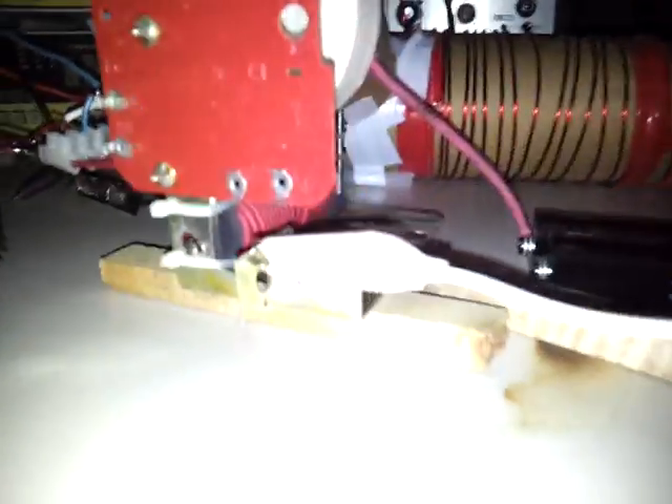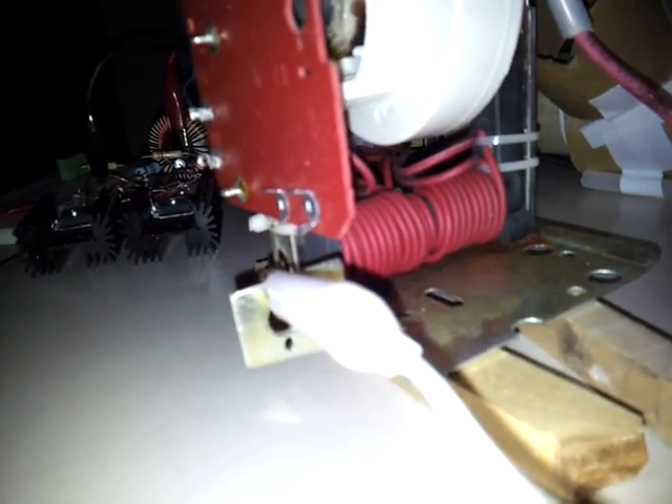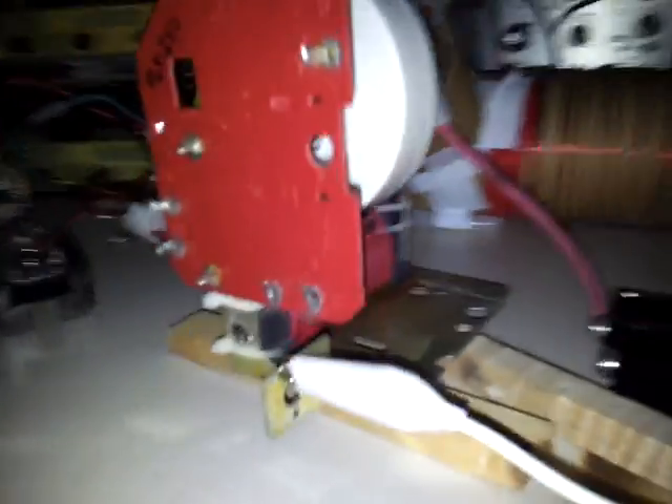The diodes are very large. There's a 3M 20k flyback transformer, and there's my red primary with two layers — it's actually two primaries. There's the high voltage coil with all these other outlets coming out, all on the same inner coil. The high voltage negative comes out here and the high voltage positive goes to the diode.